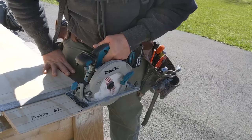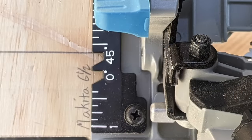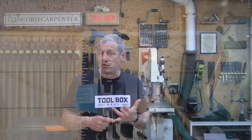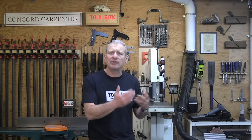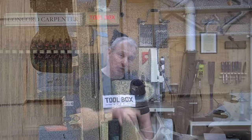For accuracy and line of sight testing, the winner was the Makita saw. These smaller saws are normally referred to as trim saws, so we were looking for good out-of-the-box accuracy. One experienced professional contractor used every single saw to cut plywood on a straight edge and ranked the tools based on performance. Saws were checked at 90 and 45 degree bevel settings. We used a single operator to keep technique consistent throughout.